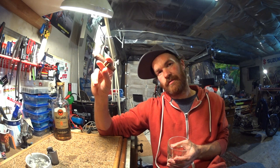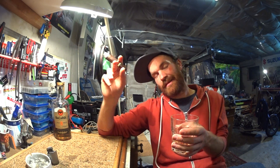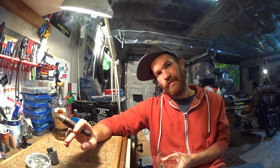You could use a neon tube and a photo transistor or photo diode attached to the spark plug wire with capacitive coupling, but with long wires going to that photo transistor or photo diode from the Arduino, that could become some kind of antenna and pick up noise. So what I'm going to do is use a neon tube attached to the spark plug lead with capacitive coupling, then fiber optic cable from that tube to the Arduino or the shield, and have the photo transistor on the shield. That way I have meters of isolation, so I think that could be a perfect solution — universal, should work on any spark ignition system and any bike, and should not pick up any spikes.